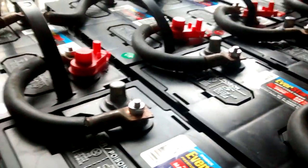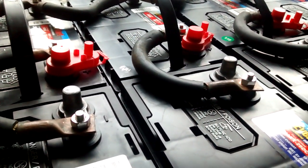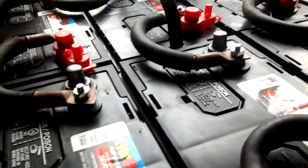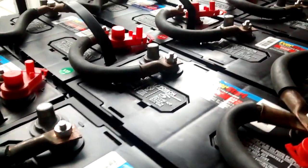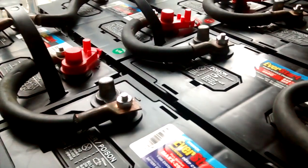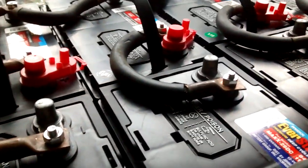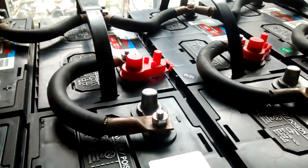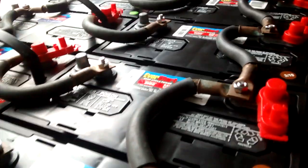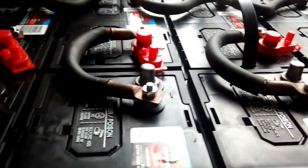Hopefully you'll have your home battery bank using the easiest, most available method. All these other battery types are a little bit more dicey. I'm not trying to scare anybody away from different types like lithium, but I definitely recommend a lead acid deep cycle — if not for the longevity, for the simplicity. Also, these can get pretty cold. Like your vehicle battery out in the cold — it still works. Lithium, when it gets down to freezing, causes issues.